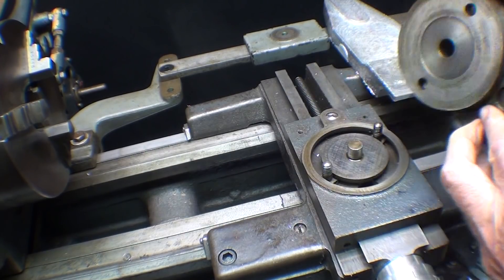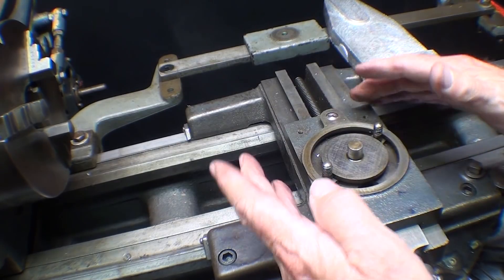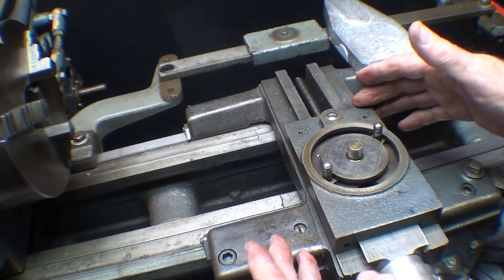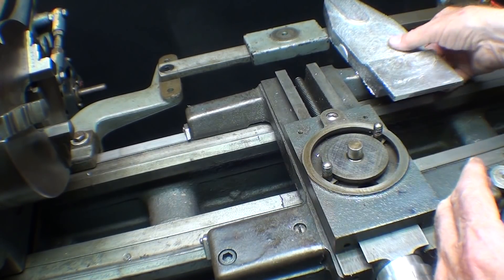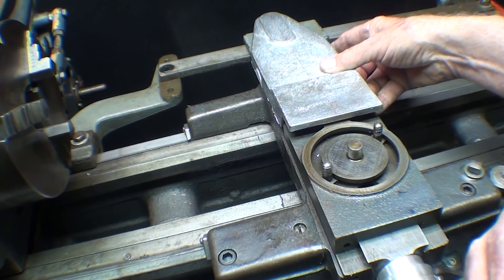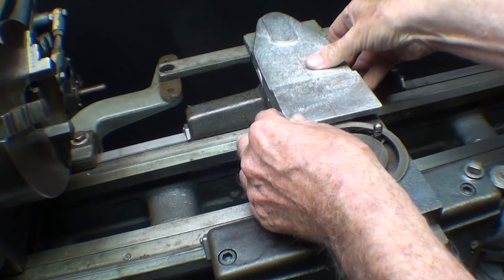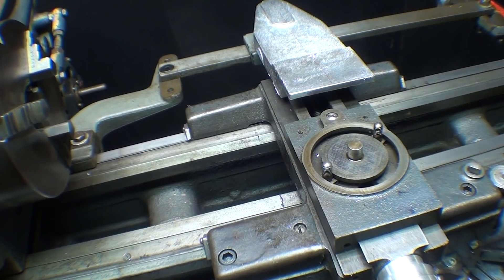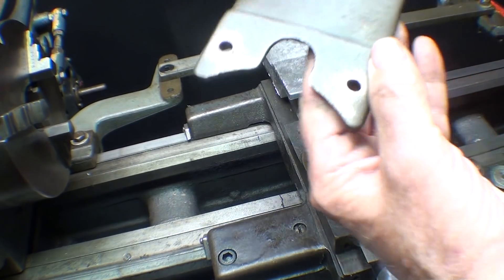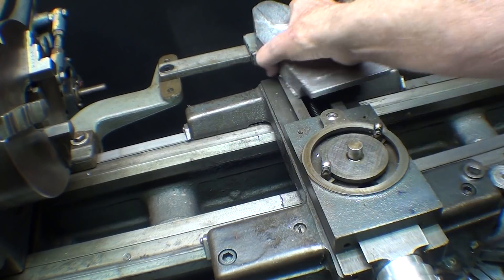Off comes the compound for a week, because this will take me several days to do. Now with the compound out of the way, I will take the cross slide off next and take it over to the bench, because I need some dimensions off of this for the dovetail. I took it off to show you how that's going to fit up. We have to have some removed here, and that will be screwed right onto the cross slide. A little bit of contouring is necessary. So that's the game plan.